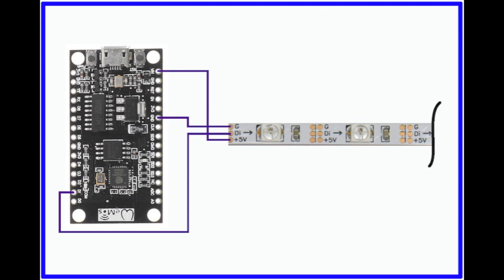It's pretty easy to hook up the LED strip to any sort of microcontroller. Here with the NodeMCU, we've just used one data line — we've used D1. D0 will not work with the LED library, so we suggest sticking with the D1 pin unless you have a reason not to. We get five volts from VIN, which is the pin on the NodeMCU that has the raw five-volt input from the USB port. We also hook up ground — that's all three lines you need to drive the LED strip. Check out the code example to see how that goes.